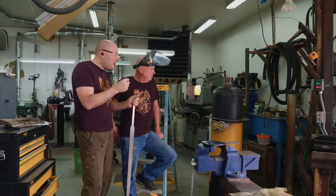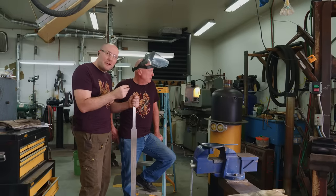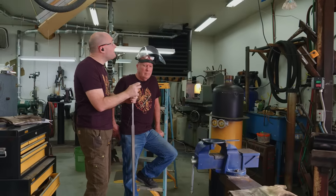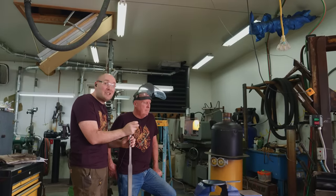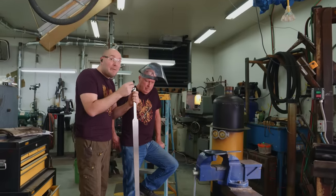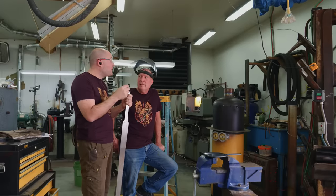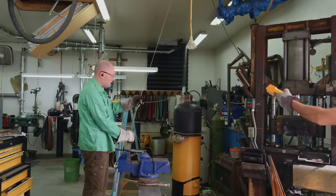So Dad's got a vent hole for the propane burners. We're gonna stick the blade down in there first, down in the vent hole, and preheat the blade before we put it in the salts. We're also gonna be using a winch system that Dad hooked up right up above here to lift the tank in and out. Well, we decided to use that for the blade today, to lift it and lower it down in there. I probably won't be able to use that winch when it comes to actually quenching the blade, because I'll have to move faster, but I think it's gonna work really nicely for the normalization process. Absolutely. Okay.